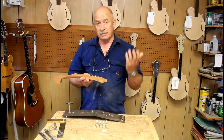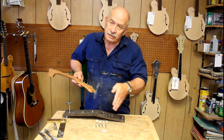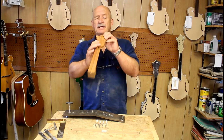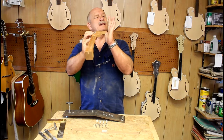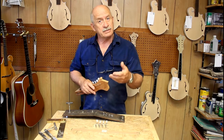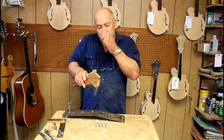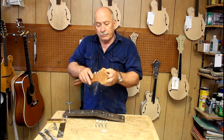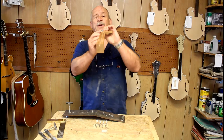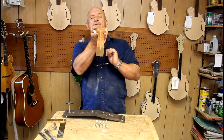I don't know if the drill bit hits something in the wood, or just the grain of the wood will cause that drill bit to want to lean a certain way, but it happens. When it does, you sight down through there and you've got one sticking out just a little funny, I take a round chainsaw file, if it's not much, or a round mini rasp, and just oblong that hole out a little bit, and just keep testing it back and forth so that when I fit those keys up there, those shafts all line up just perfect.